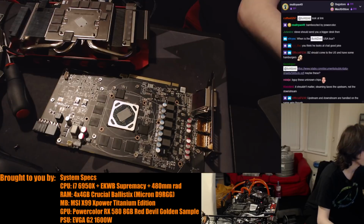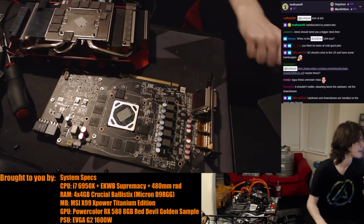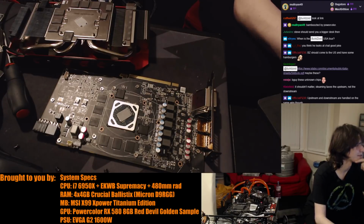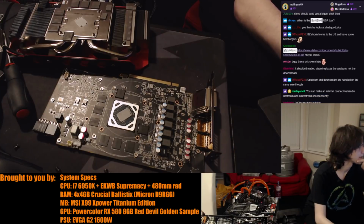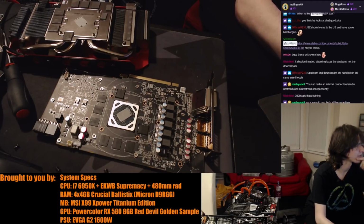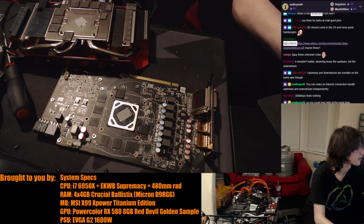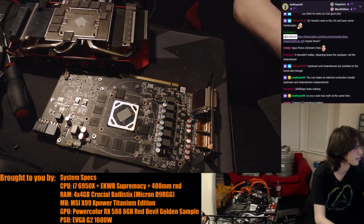So I've not managed to find these chips specifically, but the closest thing I can find is a 21240, and that's a 40 amp part. And that's not a good thing. It probably won't blow up, but... Oh, look, there's the 21242, which is the same size package and only 25 amps, so that one's even worse. Then they have a 241. I don't think they make a part stronger than this at all. In this size of chip, they don't make anything stronger than 40 amps. So it's safe to assume that this is a 35 amp part.